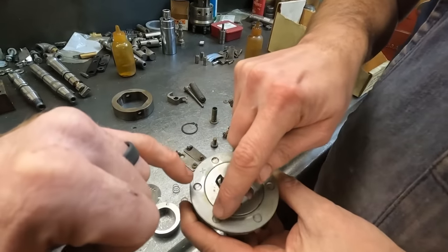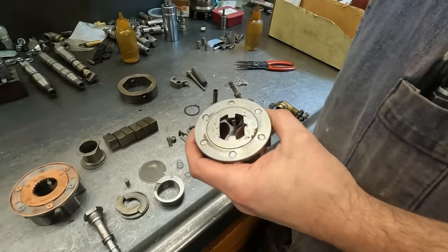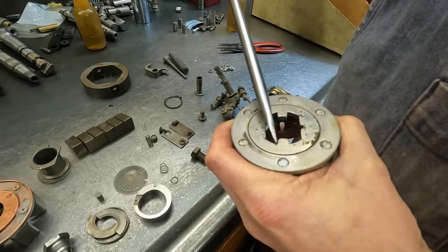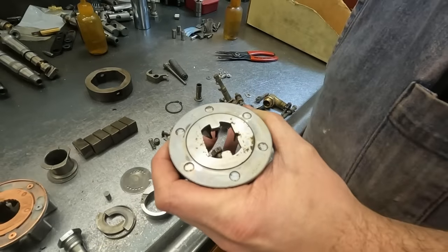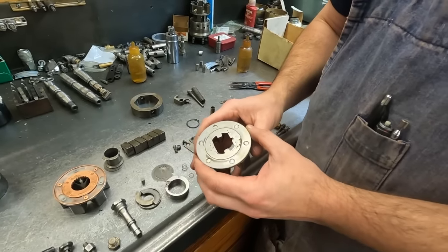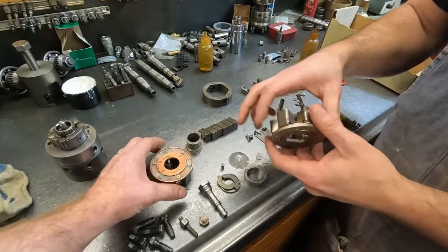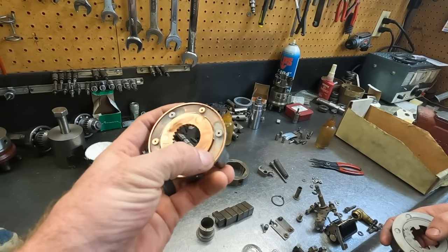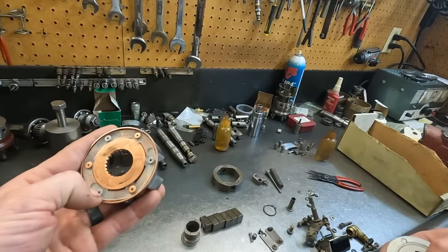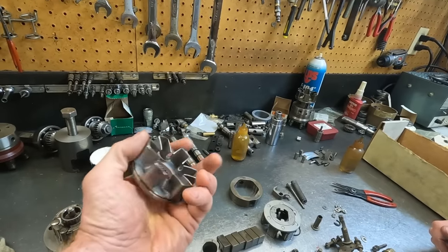Okay. So basically there's cushions on every single one of these pins. And that gives us just a little bit of play. It's very, very minute, but it gives it just enough cushion to take the abuse. Sure. But with that, you don't have the flex ring pulling apart and getting inside the pump. That last one came out of a machine from 1965. Well, it is 2022 and almost 2023. This will last a long time, so I'm not overly worried about it.